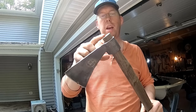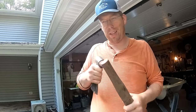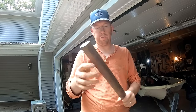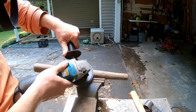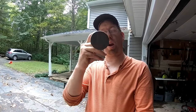By far the hardest part of this whole process is trying to shape the wood to fit exactly in the eye, because it's pretty round but it's not exactly round, and you're basically free-handing this — trying to eyeball it — it's really easy to mess up. Now I just need to shape the rest of the handle, which is not quite as precise so it goes a little bit faster. That was a lot of grinding but I finally got it done — it's pretty round, a little thicker on the bottom than the top. Now I've got to sand this sucker.